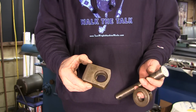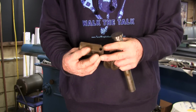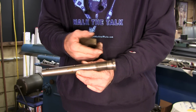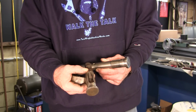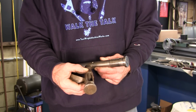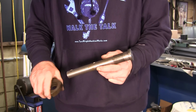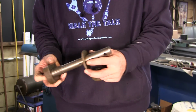Okay, here's the back side of the clapper box. It has a recess in the back side there. It hinges on a tapered fit pin. And this is the front side. This is the bar I made. It has a receiver, and I designed it after the same normal post that holds all your tool holders, that receive different angles and positions for most of your small high speed bits. So I went ahead and made that so that it slips right inside there. And then there's this big flat washer that I've used.